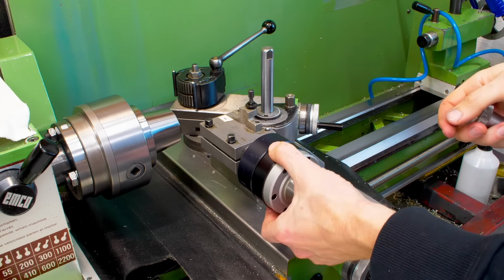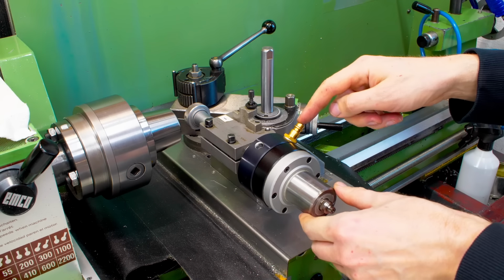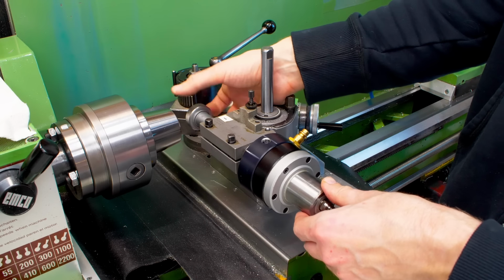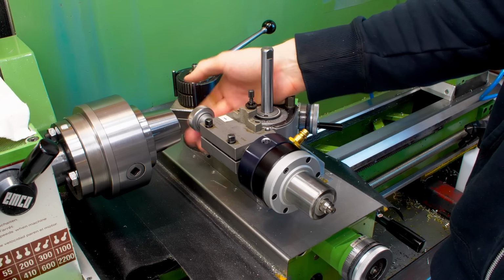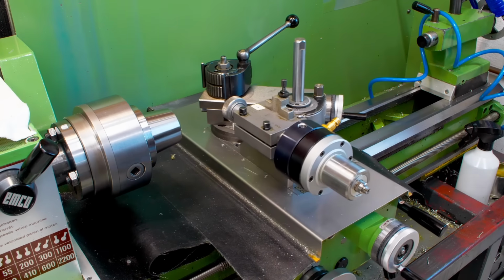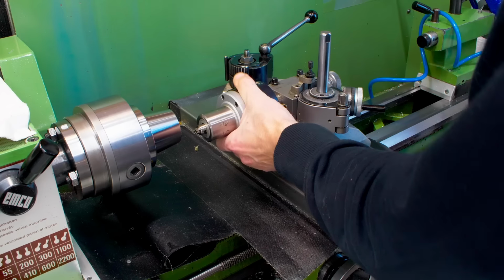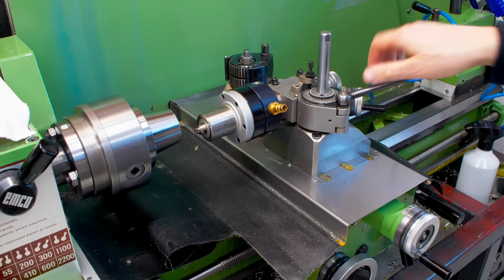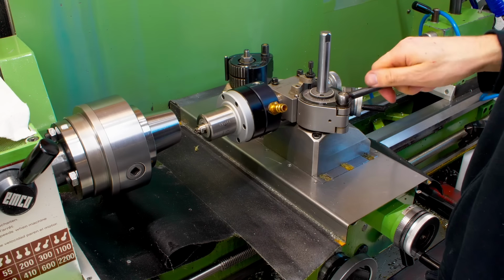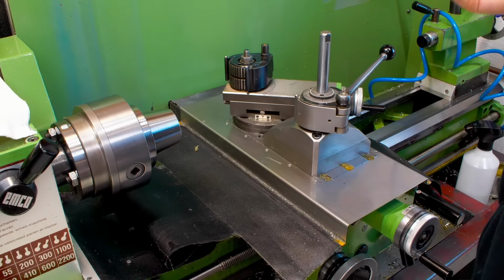This is normally meant to be used in a boring head of a milling machine, hence the rotating ring to supply air to it, so you don't tangle up the hose. But also it can be used stationary on a lathe. That's a mighty overhang, but I have used this setup before for ID grinding and it works okay. I would prefer to do it on the surface grinder because it's made for grinding, which the lathe is not.